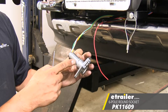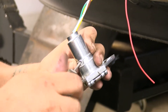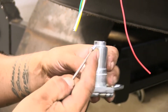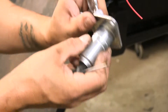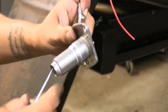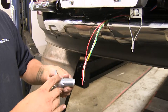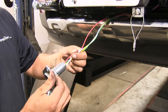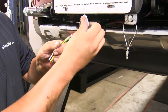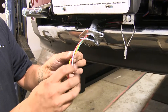The plug is going to have a set screw on the top corner. Loosen that up and remove it — be careful because these are extremely easy to lose. Open up the door and use that same screwdriver to push the terminals out until they fall out. With the center section out, open the door on the plug, pass all our wires from the back, and slide the plug as far back as we can so we have as much room to work with the wires as possible.